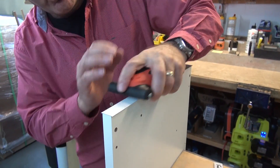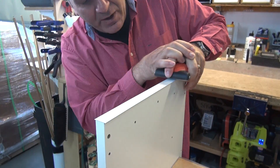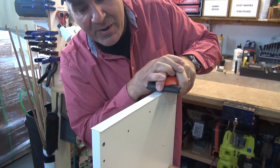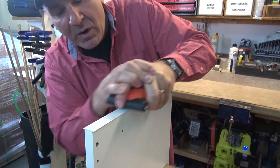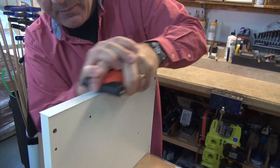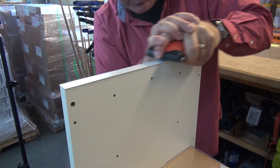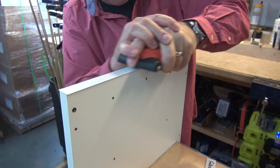Now we're going to roll it really hard — this is the important part. The reason why you want to roll so much is we're using 5.5 mils of acrylic adhesive. It's a big ice cream cake of adhesive and we don't want it just sitting on there. We want it pushed down into the grain — in this case, the grain we created by sanding with 80 grit. Really rub it well, particularly focusing on the two ends because that's the most susceptible area.